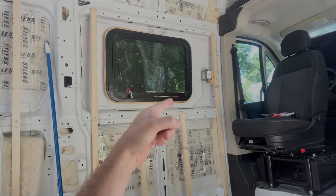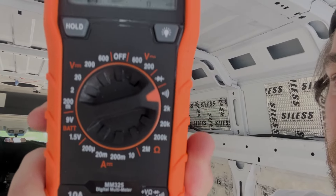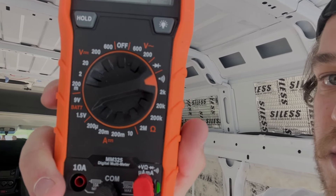This is pretty good progress today. I also didn't show it yet but I'll get a little bit more into the AC wiring — but that's our first wired outlet. I hope the van doesn't catch on fire. Here's a cool little trick to make sure that your connections are all good after you crimp them on — use your voltmeter. There's this little thing that looks like it's screaming at you right here — that's the check continuity. It means that you have point-to-point contacts. I'll show you guys quick what that sounds like.